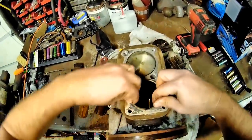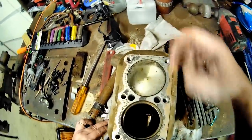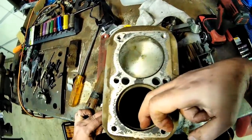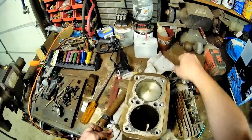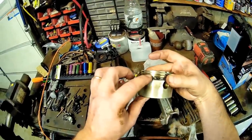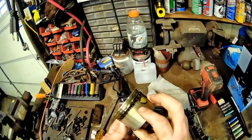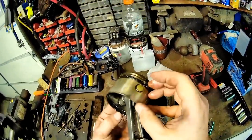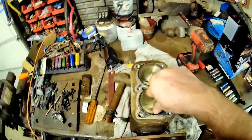These rings don't even look like terrible. These rings didn't wear at all — there's maybe one or two thousandths. Not going to get much better than that. It even has cross-hatches in the cylinder still. Compression ring, second compression ring, oil ring — of course that has the holes in it to lubricate the cylinder. And apparently floating pins on the connecting rod with little nylon bushings to hold it in. Still good, if I felt like rebuilding it.